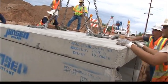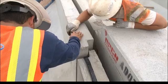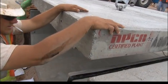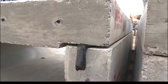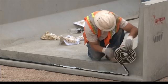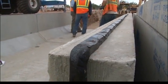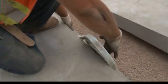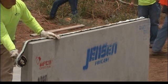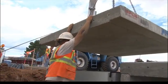Ensure both top and bottom joints are formed opposite of one another. For example, a bottom joint will be formed by placing a tongue end into a groove end, while the upper top slab joint will be set placing a groove end over a tongue. Each groove end should be sealed with the specified joint sealant and proper size prior to setting a tongue section. Common joint sealant for box culvert is known as mastic. Line the inside of the groove section with mastic and along the top of each wall where the top slab will be placed.